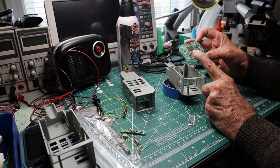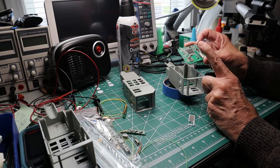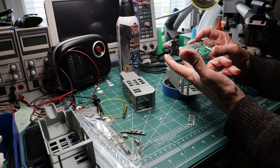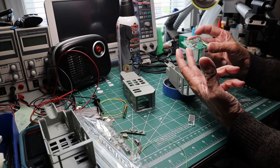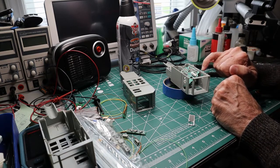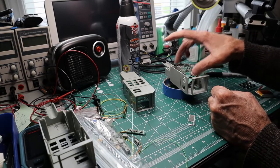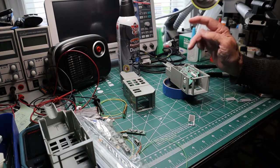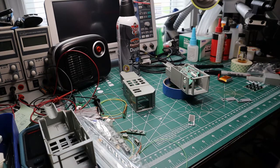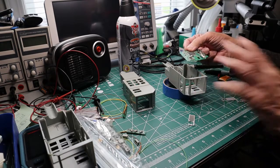For any of you that are out there contemplating going the same route, doing what I'm doing, be aware that the Spy Gear video walkie-talkies will not just fit in there. I had to do quite a bit of modding to these things, namely along this edge, which I'll focus on in a second video. This had to get cut back because the only way you can really fit the board in there is diagonally, and you're going to have to cut some of this material away again to kind of get that down and fudge it in there. But as it comes, it's too wide. So if you're going to follow what I do, be aware. You better be good with soldering and some knowledge in electronics. Otherwise, you're going to end up damaging these things beyond repair. Because not only do you have to cut the board, you have to do some other mods. So let me set this aside and I'll do a follow-up video just focusing on this.